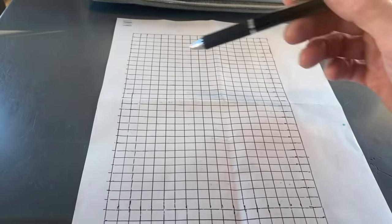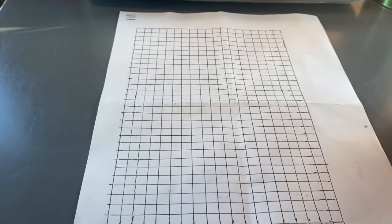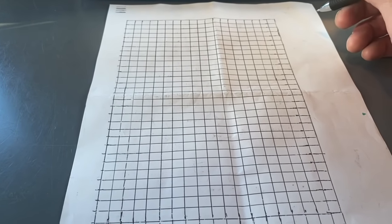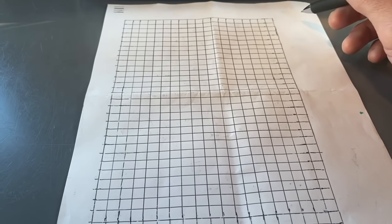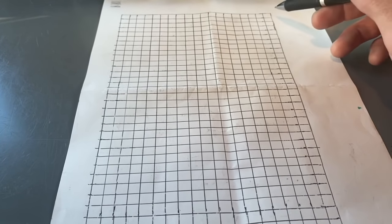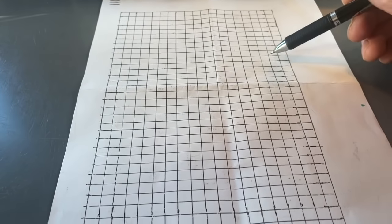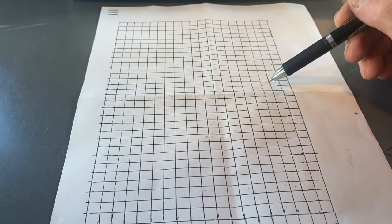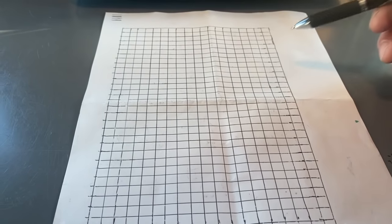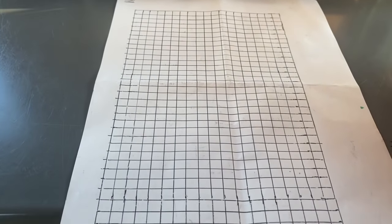But say you've got your 40 by 30 section here of wire mesh. This is my wire mesh. What you gotta remember, guys, is that 40 by 30 is 1,200 square feet. When you're running this tubing in concrete, it works really good if you put it every foot. Say these squares are 6 inches, it makes it real easy when you lay your wire mesh down. You just run your tubing every 6 inches, just count these. So if I run my tubing here, I'm gonna run my next loop two over, which is 1 foot. Real simple, right?